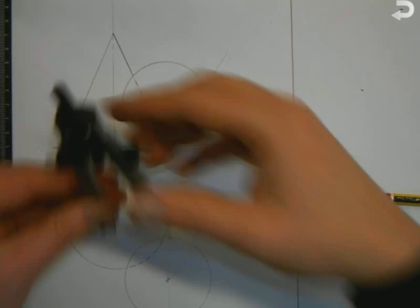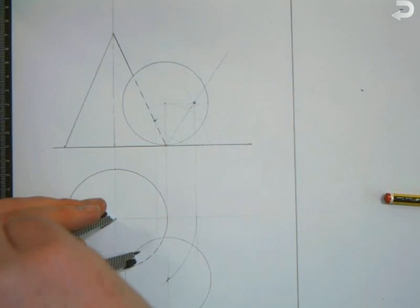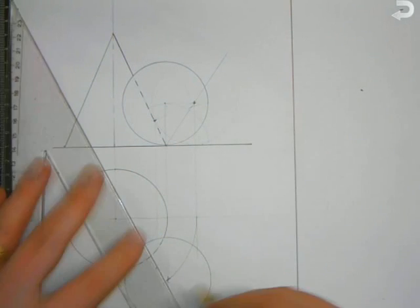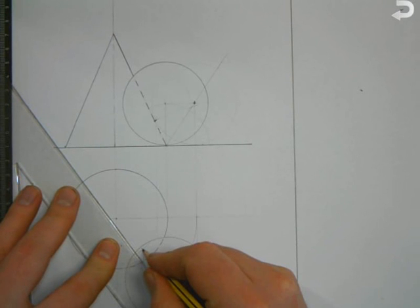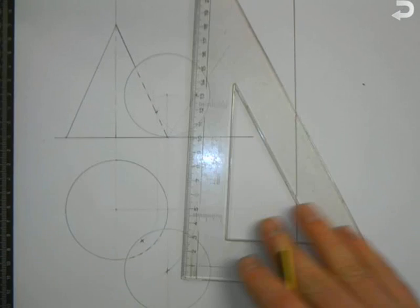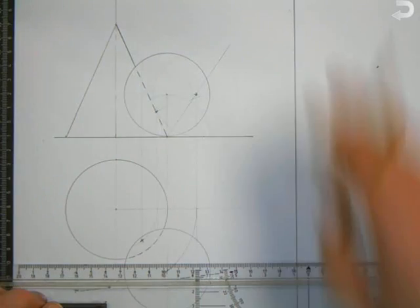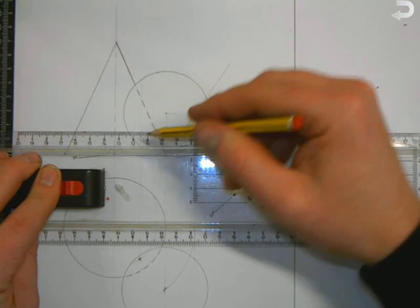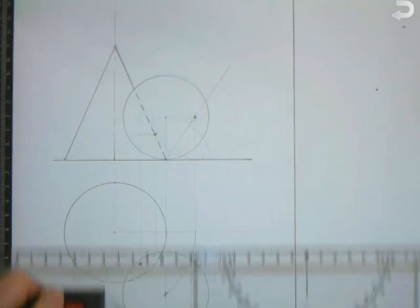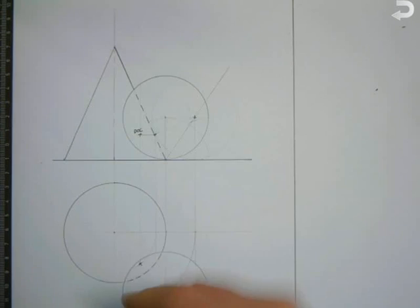The last point we'll rotate around is our point of contact. To find its location in plan we join our two center points together. We bring our point of contact vertically up, and to find where it is positioned in elevation we already have it when it's touching the side, so we just bring the height straight across. We mark off POC — point of contact — in both views. And that's all that's involved in this question.